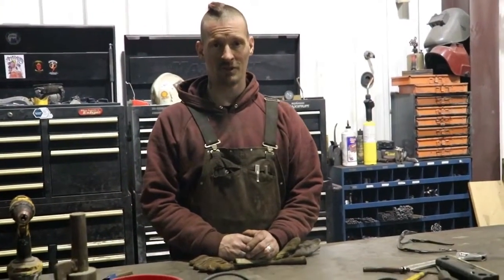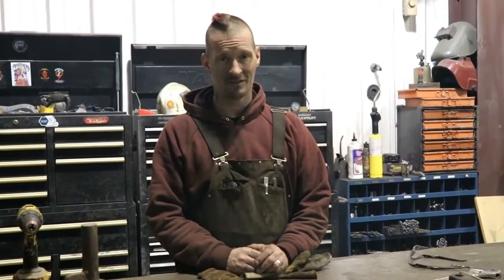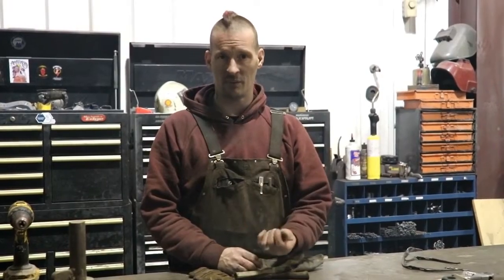Why am I choosing SMAW as a process? Because that's the one I hold valid B pressure certifications in, and that's a standard up here in this industry. A B pressure ticket is a high pressure ticket here in Alberta, where we do a practical test and then it's either bent or x-rayed to prove its strength or procedure test. I've had my B pressure now for 20 years, along with my journeyman and structural certifications.